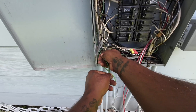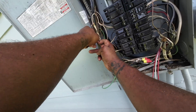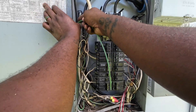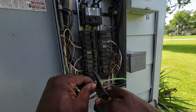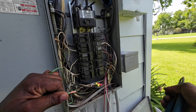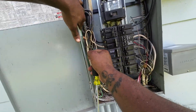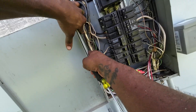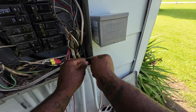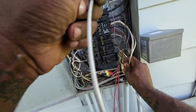With this being the first means of disconnect, I can put the ground and neutral on the same bar, but I still separated them for good practice — you never know. I wire the ground first, being careful since the panel is tight, then move to the neutral. Further in the video you'll see that I had put the two-pole 30-amp breaker on the wrong side — the main breaker setup required it on the right side, so I moved it over.